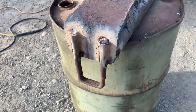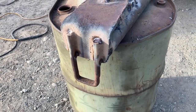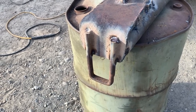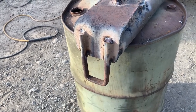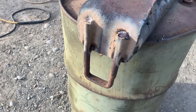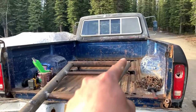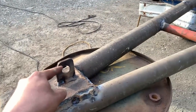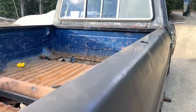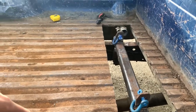For the hoist to hang off, what I've used in the past on the green boom truck is just a chunk of a U-bolt from a leaf spring pack — they're good and strong and I've never broken or bent one yet, so might as well stick with what you know. I found a U-bolt out back and welded it on there. This single tab is going to get a clevis on it like the ones behind the cab, and with that single clevis I'll do a whole loop through it and back, and that'll be the rigging for the boom — then just adjust whatever height I want.